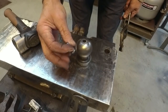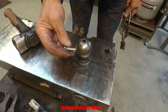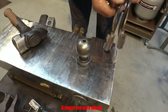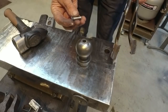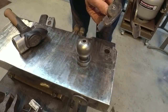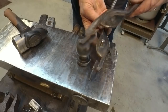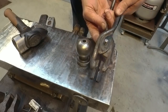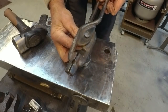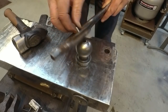Okay, here we have it. Just put it on the wire wheel, cleaned it up a little bit, shortened it because these aren't very thick in the shaft here. It was a 30mm rivet, I've brought it down to a 25mm rivet. So now that can go through there, and they can go on there, and I think that will do a reasonably good job of holding that together.